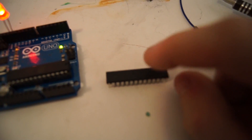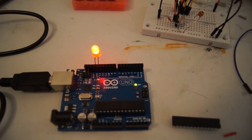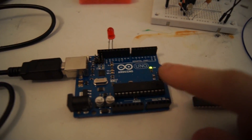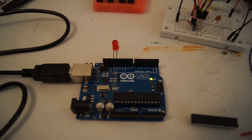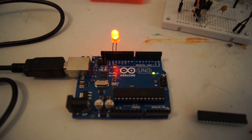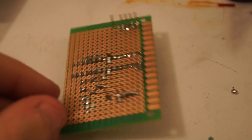So now I have all of these chips — five or six chips. This is the original chip I used to program the others. I'm going to prototype with this one, and the rest are going into projects. I want to move to soldered boards — I have the crystals, capacitors, and IC sockets so I can build my own projects, pop the chip out if I need to reprogram it, tweak the code, and drop it back in. And there is the final schematic showing all the connections needed to load the bootloader onto the ATmega 328P-PU.